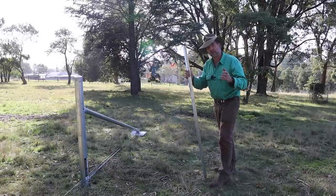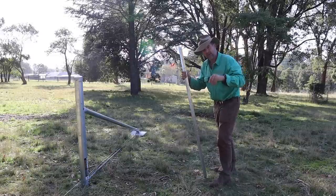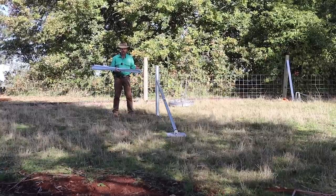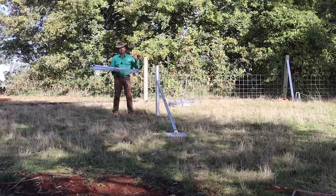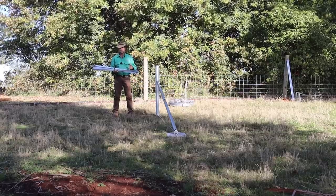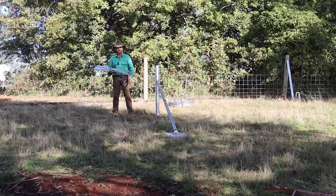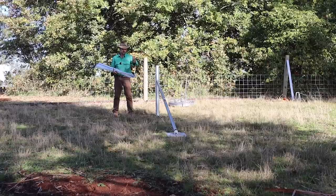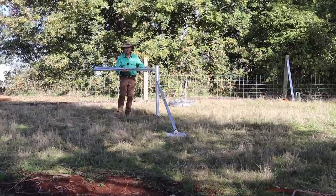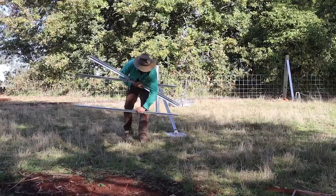Just be aware that if you're fencing along a roadway, there are specific regulations that come into effect — there's a link for those below. Some people measure every post spacing and use marking paint to mark the line. I find though, as long as you keep your strides relaxed, you'll be surprised how close you can get with your individual measurements. With the wire on my left-hand side, I take off from my right foot — that gives me four good strides, with my foot landing on the wire where I've got to point the post with each measurement. One, two, three, four — post.